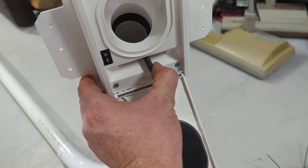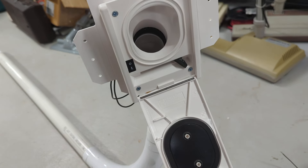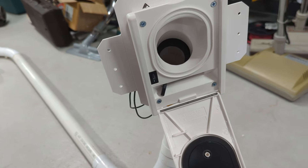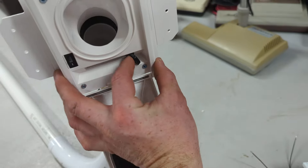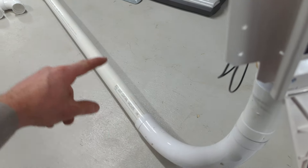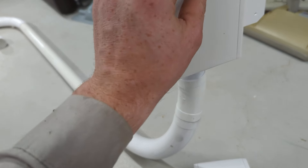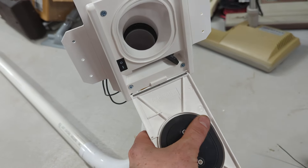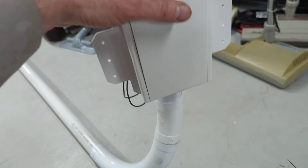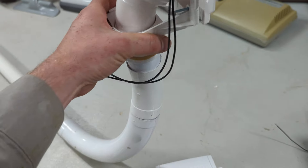It's the same locking mechanism whether you're at the end of the hose or partway down. To use it, you pull the hose out, lock it, turn the system on, do your vacuuming, and when you're finished, you unlock — keeping the system running — and putting your hand over the end of the hose causes the suction to draw the hose back into the piping. Then you shut the door, which pushes the switch and turns the system off. There's a gasket on the door, so this box needs to be air-sealed for there to be no leakage elsewhere in the system.